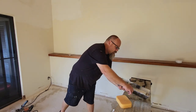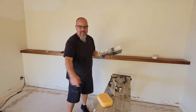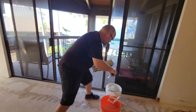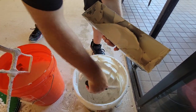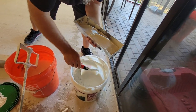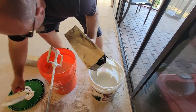Another tool I like — this is what I do with my drywall knife. You don't want to get it wet or get chunks from the ground on it. So I clean it off and set it in the ladder to keep it clean. This tool is called a drywall scoop. I love it — it's contoured to fit a bucket, so I can scoop right out of my bucket and load my pan really fast. I don't load a full pan every time — about halfway. I did a really good job sweeping and blowing this floor out prior to starting this project.